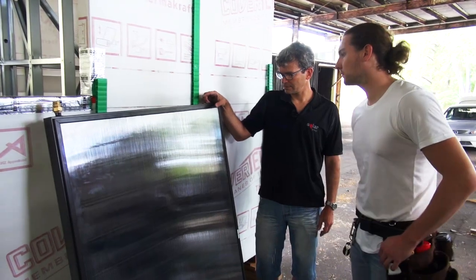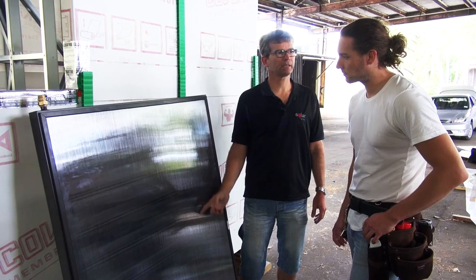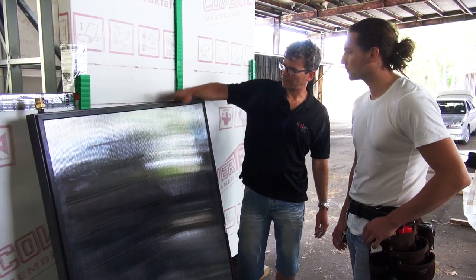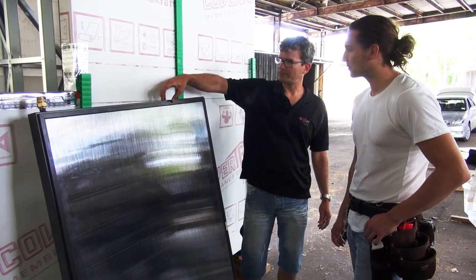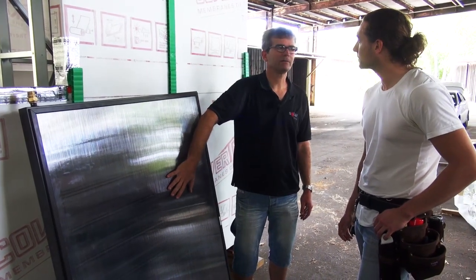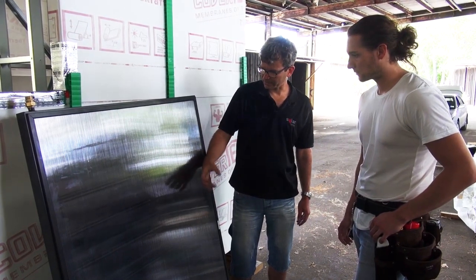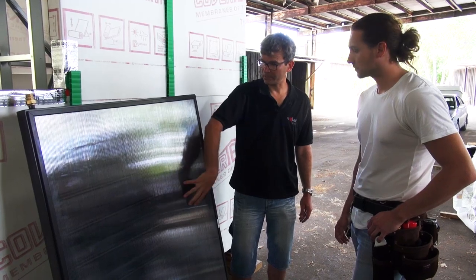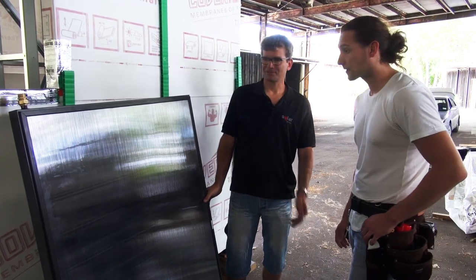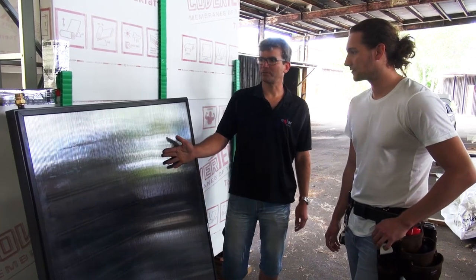The matrix inside the panel is made of copper. There's selective coating paint on it, so the whole surface inside is made of copper and the casing itself is made of galvanized steel. But instead of having glass like we have normally for domestic houses, we have here a polycarbonate, which is still tough enough, but we have no risk of breakage because this needs to move and travel. You may have a branch falling on it or something, so we prefer to keep it simple. And it will be easier to replace if need be as well.